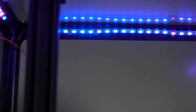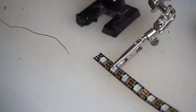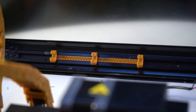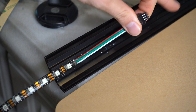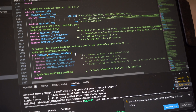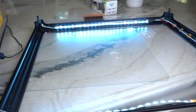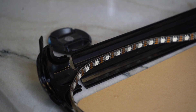For the LEDs, all these peripherals are running on a 12V power supply I borrowed from my neighbor's network router. The LEDs are some WS2812s I had left over — they don't fit in the gaps in the extrusions, and I even tried lubing them up with no dice. So I made these wire LED holders that slide into the extrusions and hold the LEDs in place. The LED strips are powered by 5V, and since 5V is not 12V, I installed a buck converter to bring that 12V down to a usable 5V. The LEDs are going to be driven by the firmware of the printer using the NeoPixel pinout on my motherboard, and they also have to be spliced and re-soldered to properly contort to the shape of the enclosure.